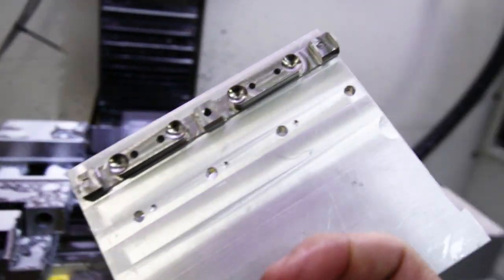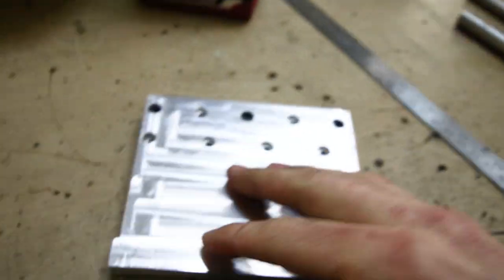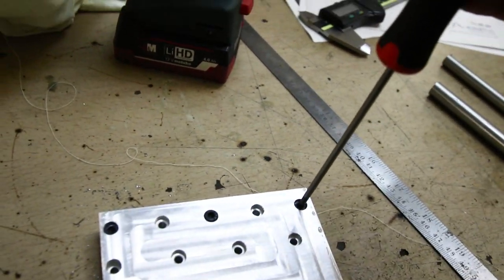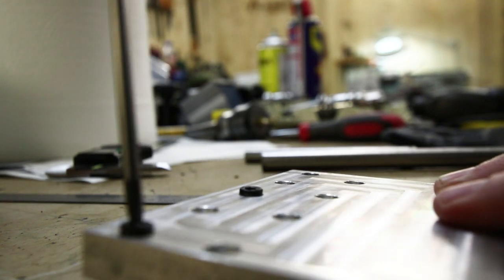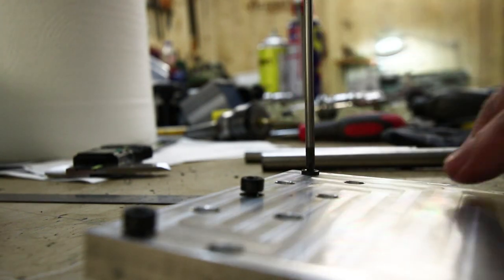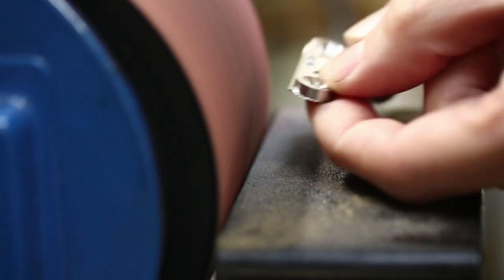So this is how I've been making custom joints lately. Holding the parts from behind the fixture, that is a technique that I took from knife makers. Making each joint took me 2 days. Seems so easy here, but there is a lot behind it. You have to draw it in 3D, program all the operations, machine it, check that everything is right, and most of the time, the first try is not dialed in, so there's always something wrong, so you have to repeat it.